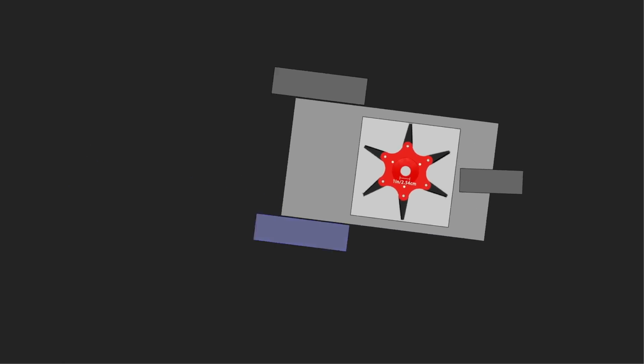Okay, I have razors with a motor, but it's a static block. To move this cutter, I need to create the rest of the body, which will hold the cutter box and allow me to move the whole construction left and right. I will use a 3-wheel setup, 2 front wheels and 1 rear. If the left wheel has more speed, the lawnmower will move to the right. If the right wheel has more speed, the lawnmower will move to the left, and the rear wheel will be turned accordingly. And finally, if the speed is equal, it will move straight.